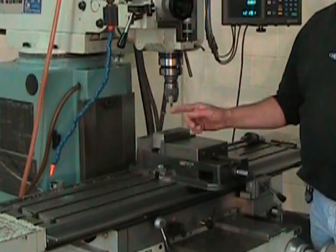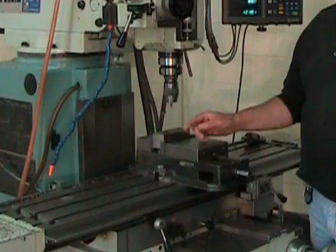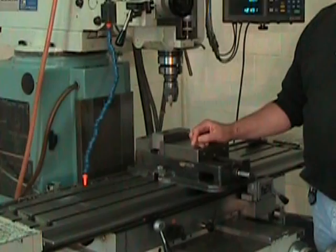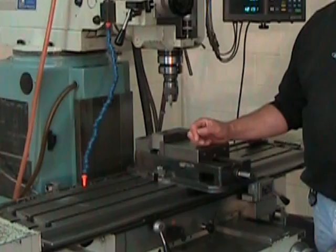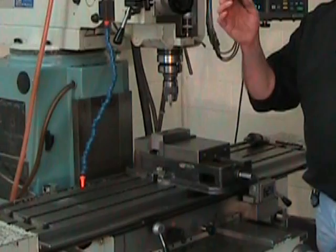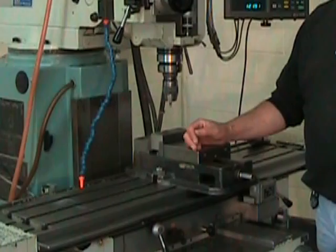And those two holes will give me two big advantages. First advantage is it gives somewhere for the liquid coolant to go, and that helps me to see what I'm doing. So if the liquid can go through the part down by gravity, that's very practical. The second advantage has to do with the cutting tool, because we're going to be using a 2-flute, 3/4 inch cutting tool, and those 2-flute cutting tools can cut while plunging, but they don't cut very well. That's due to the fact that even if the tool is turning at a certain RPM, its center really has a motion of zero. It's not really moving.